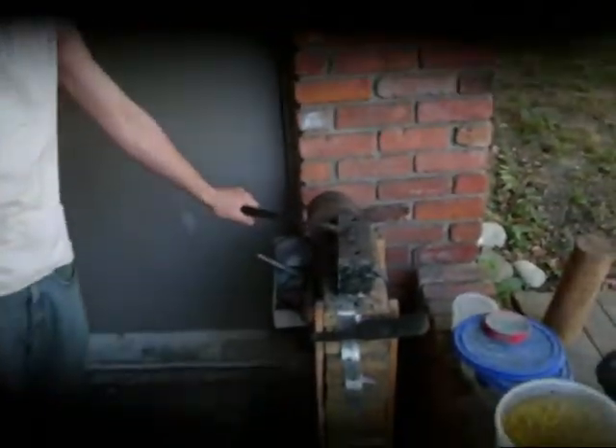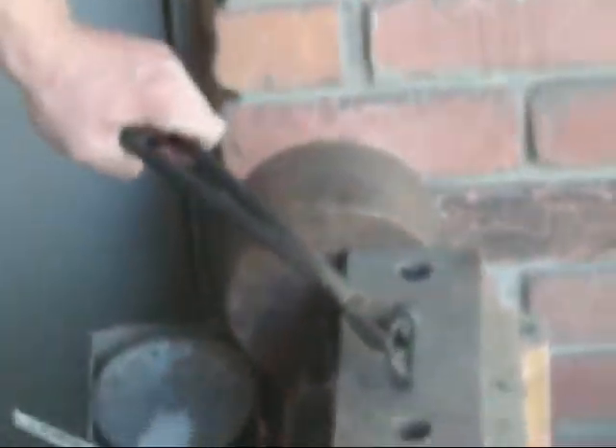This is quarter inch rod on my anvil, and this is a one-pound ball-peen. I'm gonna see just what it takes to break this. This was one heat and about maybe six hammer blows. As you can see, it's starting to deform. That thing is holding. That's my first forge weld - it's about to break. A couple more blows and it would break. Thank you to Mr. Gary Huston for explaining how to forge weld. Everybody have a good day.